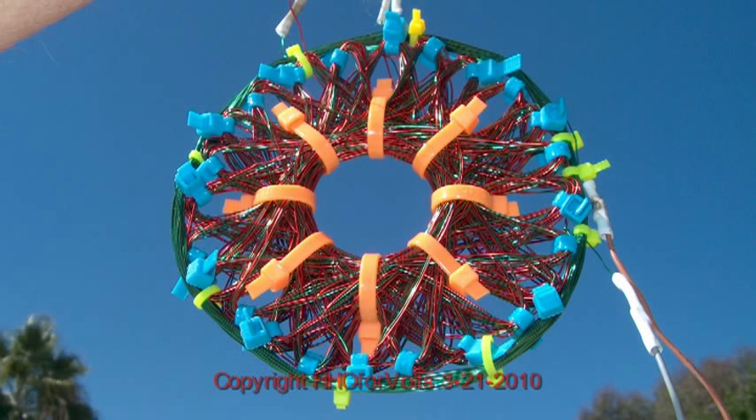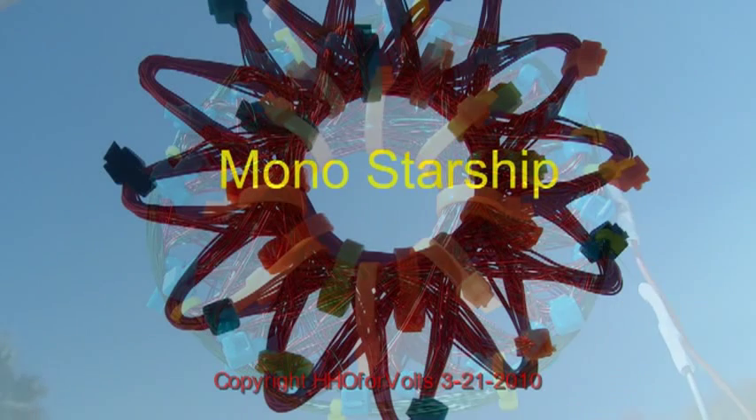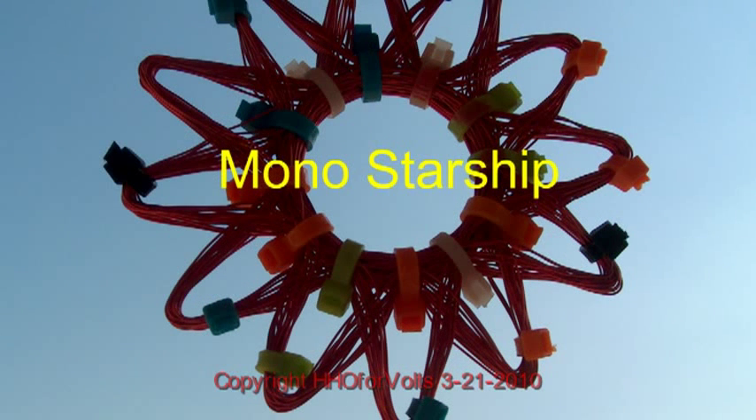This is going to be on my Bedini. I'm passing the magnet through the center, not over the top of the field but through the center. I think that's going to work out well because there'll be a magnetic pole to pull and then pulse away on the other side. I have to work on getting the spacing right and then the trigger Hall effect transistor.